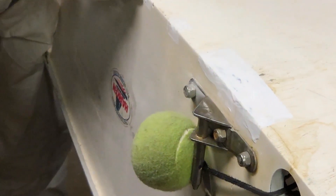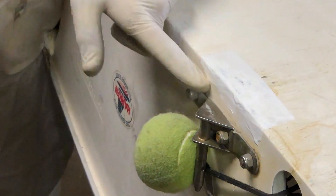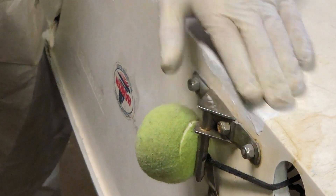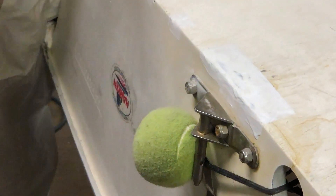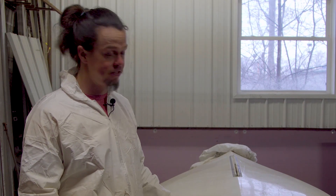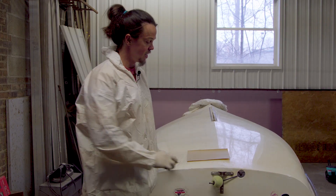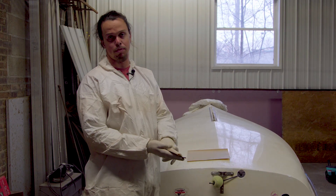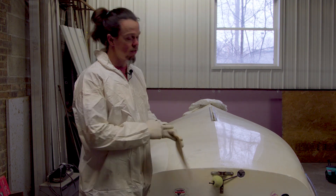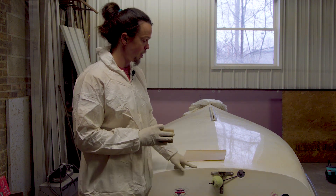What we'll have to do next is take our sander — and probably by hand because this is such a tight area — and take this down to final thickness with a really fine grit sandpaper. I've got a couple of different grits here. I'll start with 150 to prevent fatigue doing it by hand, taking off a lot of this material first, and then we'll go down to 220 for some final leveling of this gel coat.